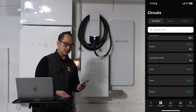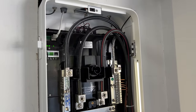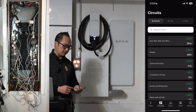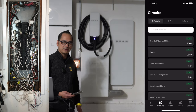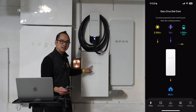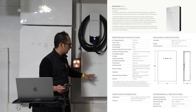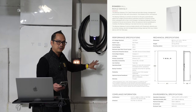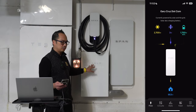Other than that, I really like the visibility of the app — it's clean within the actual panel itself. I didn't have to hook up any additional wiring to get readings from my different circuits, which is another great advantage of the SPAN panel. The way this works is that SPAN has an ethernet cable plugged into my Tesla gateway — the gateway is what determines where you're going to get power in your home: from the sun, the grid, or the battery.